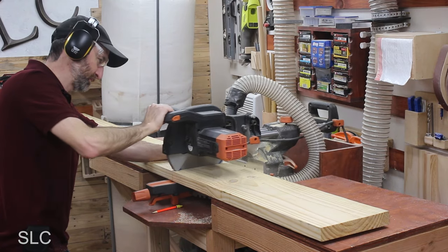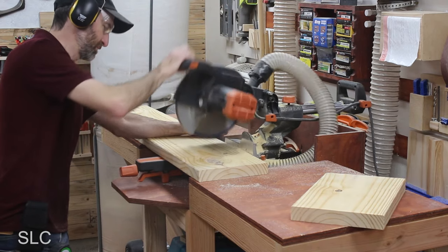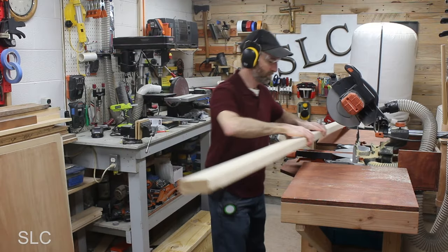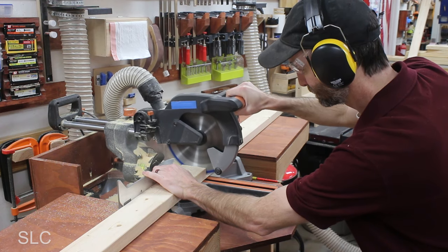The initial plan is to have some hidden storage under the bed, plus some LED lighting to really emphasize the floating feature. All of the wood I chose for this bed is standard pine lumber found at my local home improvement store. For the base, I used 2x10s, 2x4s, and a small section of plywood.